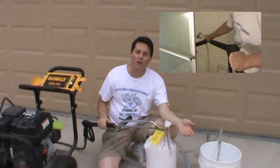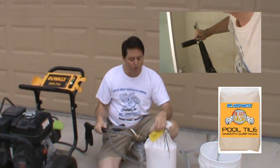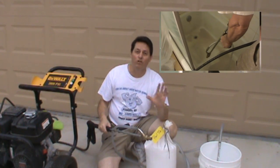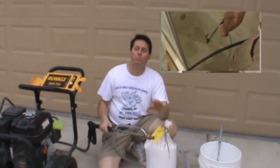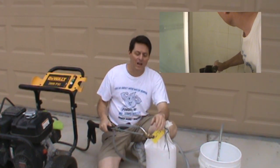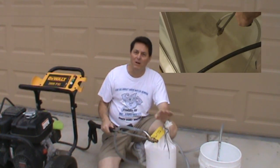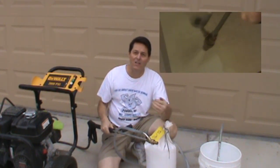It's really the combination of the water plus the media that's going to do the cleaning for us today. I've chosen the pool tile blast media because it's the best media for this type of shower tile — it's the same type of glazed tile so it's going to work really well. This media is pH neutral and water soluble, so it's very easy to work with. It's non-toxic and eco-friendly. On the porcelain tub, which is really damaged, this media is going to clean it safely — it's not going to pit the surface or damage it in any way; the crystals are just going to clean that surface.